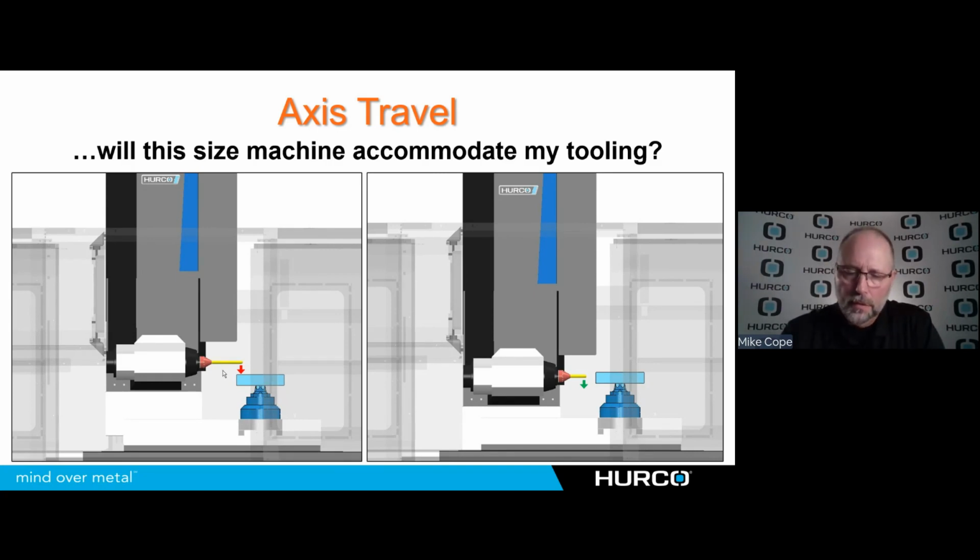So again, there's way more to consider when I'm looking at a new 5-axis than just in a 3-axis machine. In the XYZ travels, tilt angles and so forth aren't always telling the whole story. I really have to take a look at the processing and how I'm going to process these parts to determine if there is any of these type of issues that show up, or even ones that we may not have discussed here that I can see coming down the pike because of the way I'm going to be holding a part and so forth.